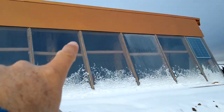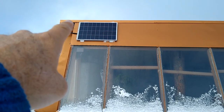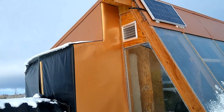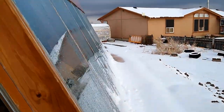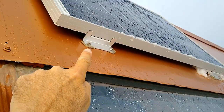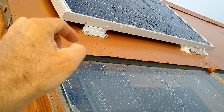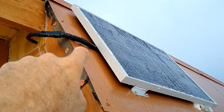Going outside, we have the solar panel on the outside of the building. These little Z-brackets turned out to be impressively strong — I'm pretty happy with those. I used the self-drilling screws that came with the kit since they were adequate size. I pre-drilled the holes and used some mobile home butyl rubber tape — an inch by an inch piece doubled over — underneath the Z-bracket before putting the screws through, to seal around the holes and keep moisture out.